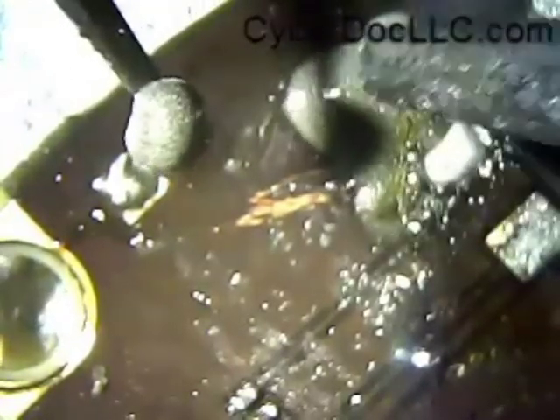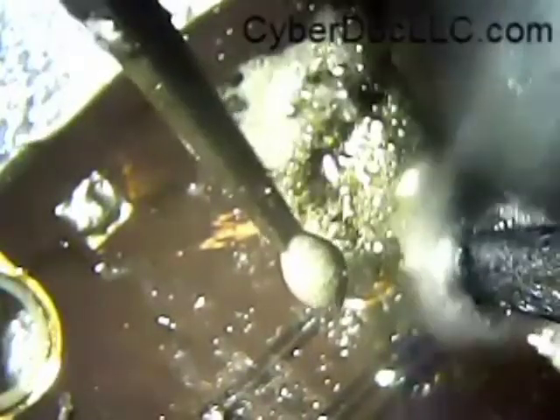This is a different kind of low melting solder. The solder you saw before was in bar form — that melts around 50 to 60 degrees Celsius. This is a quick alloy low melting solder paste. It's also considered low melting, but it melts at 137 degrees Celsius instead of 60 degrees Celsius.